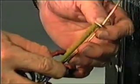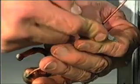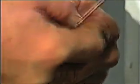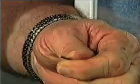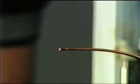The cap tube is too small to cut with a tubing cutter. The cutter will collapse the end. So what you need to do is just score the tube with a file and break it off. Check to make sure that you've got a clean break inside here. You can't have any restrictions in this tube that would affect the flow of refrigerant.